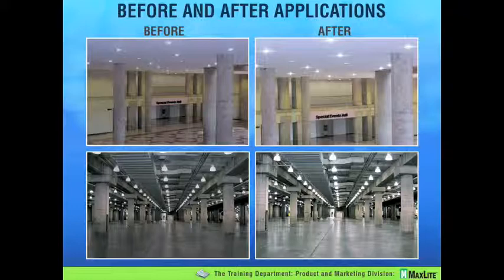On the bottom side, which happens to be the same facility, you see a 400 watt metal halide. These were varied in life. They don't do group relamping — they do one-for-one replacement as required. My observation is that a few dozen have to go out before they'll get the lift out and replace them. They're certainly not doing anything close to group relamping. On the right side, you see a 150 watt HiMax just after the first show following the initial retrofit.